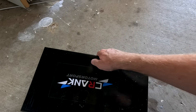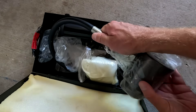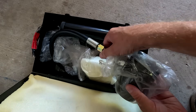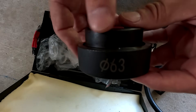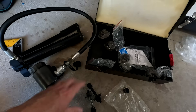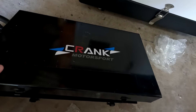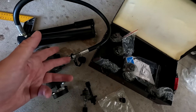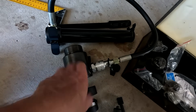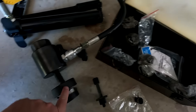For this we are using a tool we haven't used for a long time — the hydraulic hole punch! We used this a lot when we built the battery shelf to punch holes through the aluminium sheet, and now we use it again to punch a hole in the outside wall of the garage. We've got a 63mm die that should work. This set was not cheap — around 260 to 280 dollars from eBay from Crank Motorsport. It's the perfect tool to make clean holes in all kinds of material: aluminium, steel, stainless — doesn't matter. Very strong pump and cylinder. Let's get this on the way and start with this small one to make room for the big one.